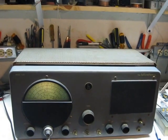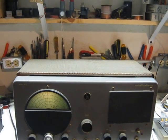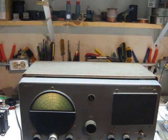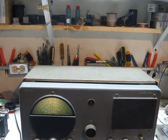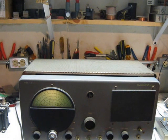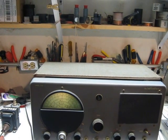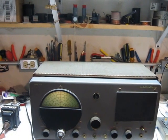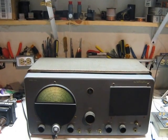Anyway, just wanted to share that with you. A neat old 65-year-old radio from 1948, still working now with probably the original tubes. I haven't done much with this other than realign the IF transformers and reset the BFO. I haven't even pulled the tubes and checked them yet. Really cool to see a radio run this long and not have any problems. 73 from WA3TTS.